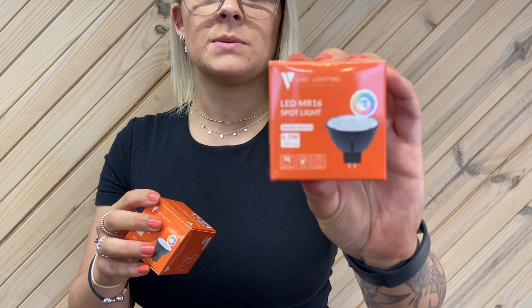Here we have a direct replacement for a halogen MR16 — the MR16 being with two little straight pins, being 12 volt, so they need transformers to go with them. These ones are high CRI downlights, so they do have a high CRI of 95, meaning that they show the true colour — perfect for printing, any arts and craft areas, or also for dentistry and so forth.